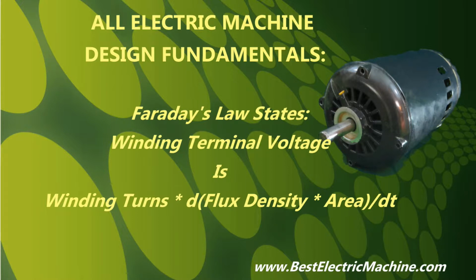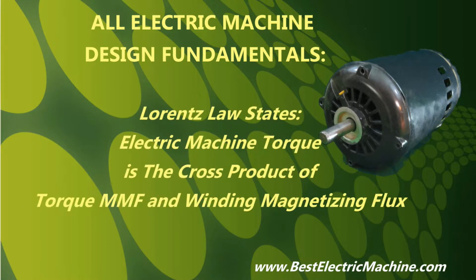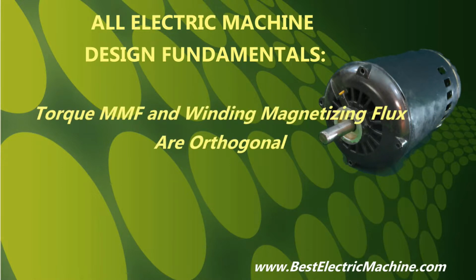and the time derivative of only the magnetic flux passing through the area of the winding, or magnetizing flux. Magnetizing flux is proportional to the energy product of a permanent magnet assembly or the magnetizing MMF of a winding or reluctance saliency assembly. In accordance with Lorentz law, torque is proportional to the cross product of the torque MMF vector, of the active winding set, and the magnetizing flux vector, of the air gap, and as a result, torque MMF is orthogonal to magnetizing flux, or magnetizing MMF.